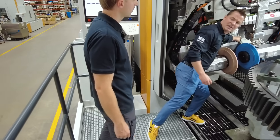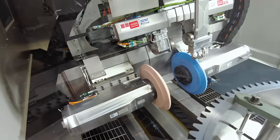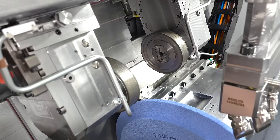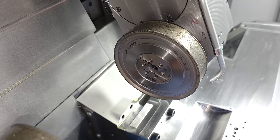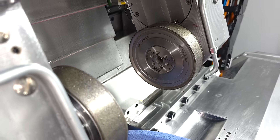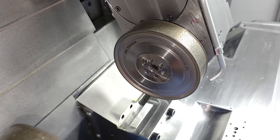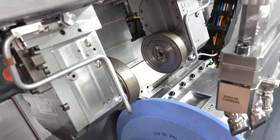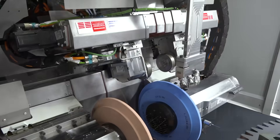I notice a piece here as well, Toby. Does this have any significance? It looks shiny. That's a dresser. We have two spindles for the dresser. There is a hydromandrel on the machine where you put on the dresser and fix it with only one screw on that spindle. The runout is within one to two microns, which is absolutely necessary for the operation as a dresser.